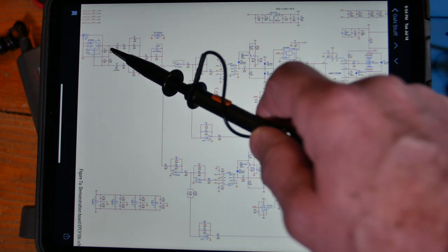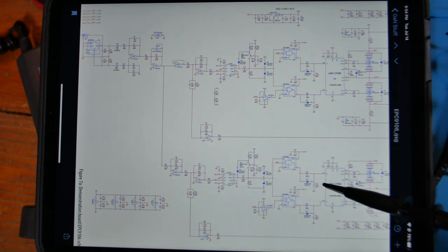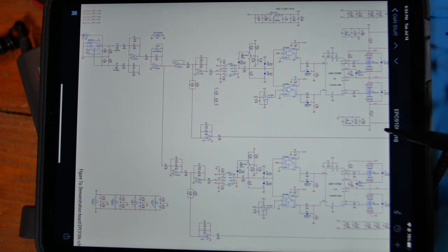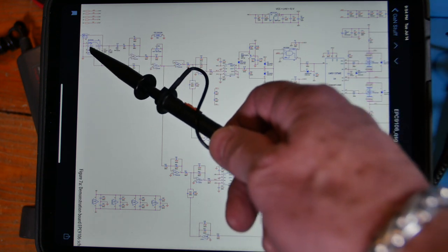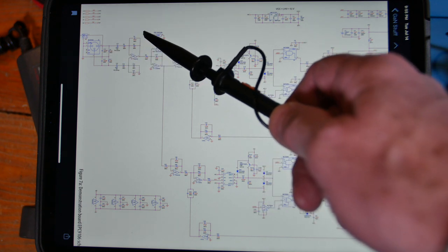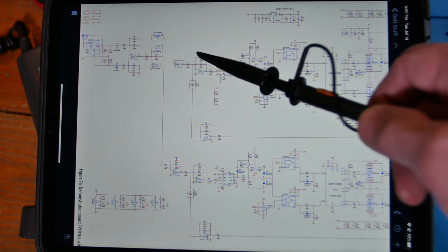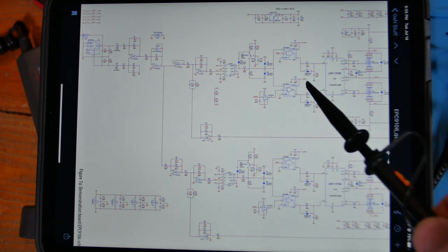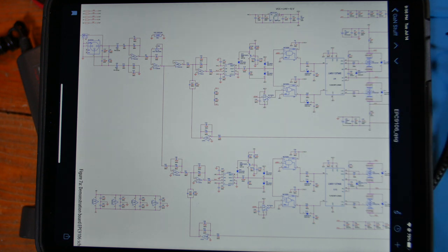Here is the break-off point. After you come through the volume, we kind of come into a Y configuration where the bottom two FETs of our bridge get driven by this circuit and the top one here. You can see our feedback coming here, the feedback on this one coming up here. We're going to trace the signal right through, see it in this gain stage, and once we go through the gain stage we can adjust the volume and see it go up and down. Some of the circuit's on the bottom side of the board, so we'll flip the board as needed.